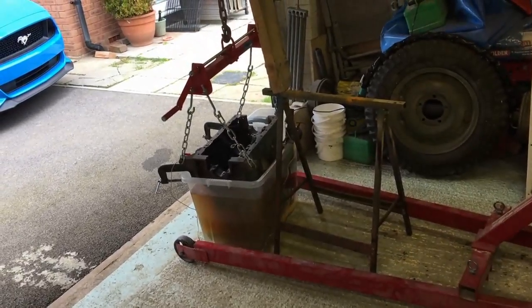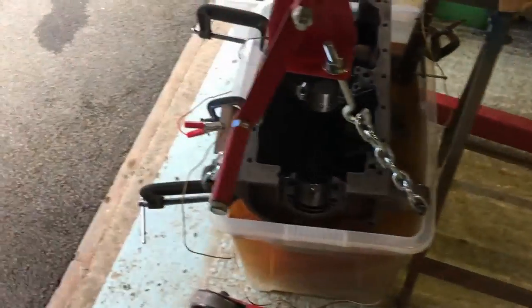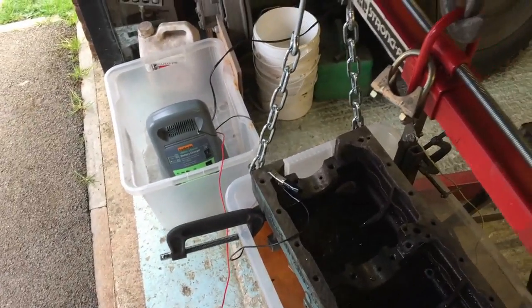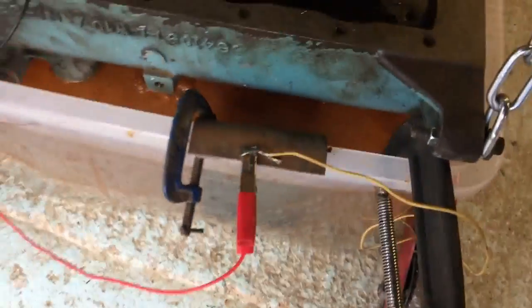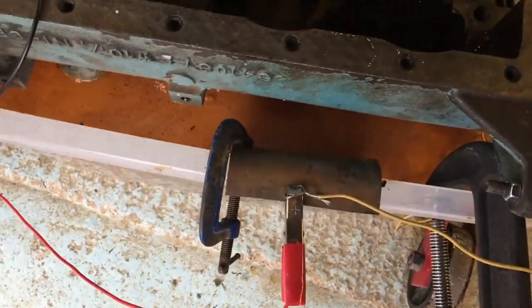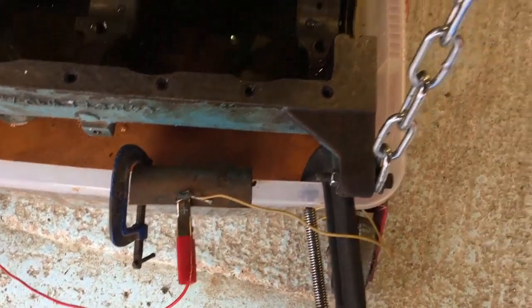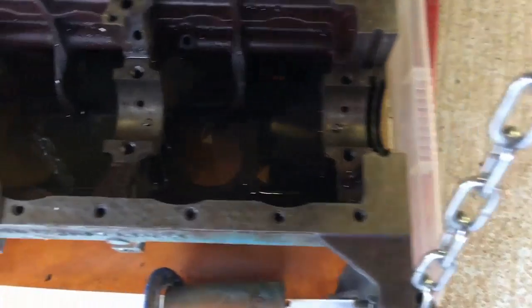That's the six o'clock news so it's been an hour. I've got a piece of wood in there to support the ram should it start to fall during the night - I really don't want that to sit on the bottom of that plastic box. I've added a couple of G-clamps - one here, one over there - to keep the block away from the anode. The block is the cathode, the pieces of metal are the anode, and I've also added another anode over there - a couple of bits of scrap tube. If you're doing this, the piece of metal you use will become scrap. So the block is negative, these are positive, and the block is discharging through those anodes in opposite corners.